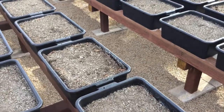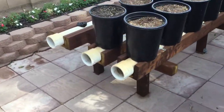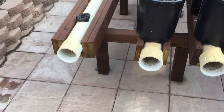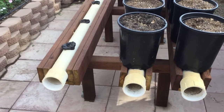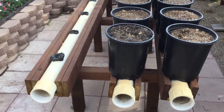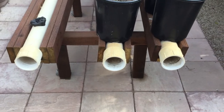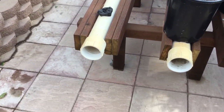My suggestion based on what we learned: use two-by-six and glue and screw them together, then on a table saw or hand rip-saw, cut off one edge all the way along to make the board height the same as your pipe. That's much easier than the way we did it and seems stronger. You might get by with a single board, but in our area it warps. I like the security and strength of the double.